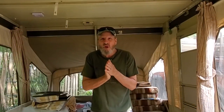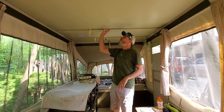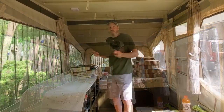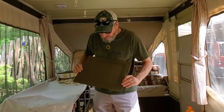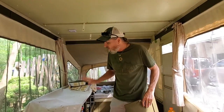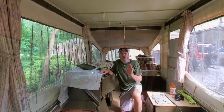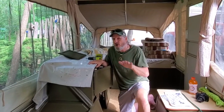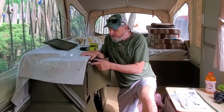It's been a pretty good project. Got the Sweet Jasmine applied to the top, got the Primitive around the top border, and put the doors and drawers back together. Need one more coat, but a lot of times you can go ahead and add that additional coat once you get them put on. When you paint something, it takes two to three days for the paint to really set up as hard as it should be, so be careful with it because it's very easy to nick the paint when it's very fresh and very soft still.